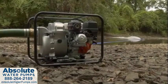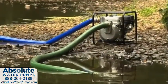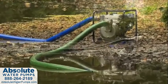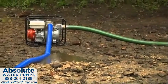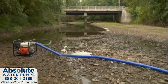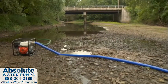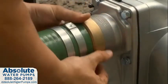The cast iron pump casing is lined with stainless steel, with a long life silicon carbide mechanical seal that resists corrosion, wear, and heat much better than a standard seal. A high chrome impeller and cast iron volute last longer and reduce vibration for trash applications with an adjustable impeller height that makes it easier to use. The centrifugal design includes 3-inch suction and discharge ports.